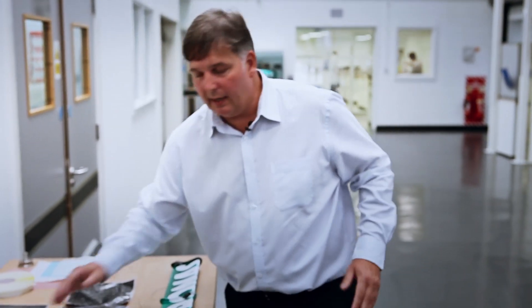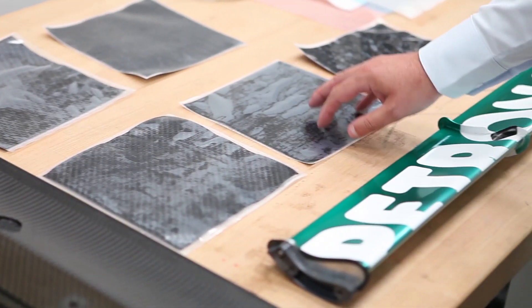All the material that's on here at the moment is still green and supple, and once it comes out of the autoclave it's cured in this state and it's in a usable state. When we talk about carbon fibre we often talk about it as a generic, but there are numerous different carbon fibres and numerous different resin systems that we use. We've got five harness, plain weave, two by two, unidirectional, and checkerboard material. Depending on where they go on the car, it depends on what sort of resin system — whether it's lightweight, whether we want tougher or stiffer materials. For the back of the car suspension-wise you'll be looking at stiffer, tougher resins; bodywork-wise where you're looking for light bodywork you tend to use the checkerboard material.